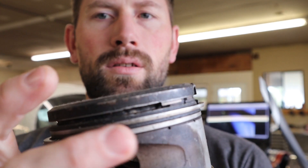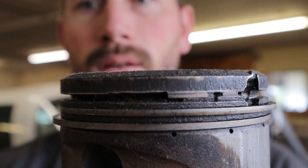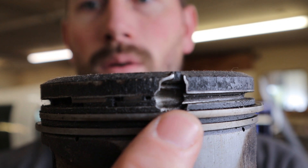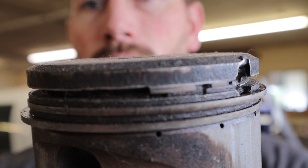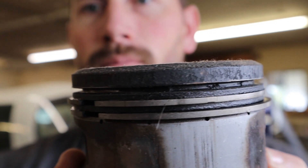Have a look at this — you'll see I have two rings jammed on top of each other. Broken. And then there's this big hole. I don't know what caused that hole — a broken piece of ring rubbing back and forth — but it actually popped out at the top. Really odd. Had I had the bore scope and just popped those spark plugs and had a look in there, I would have noticed something was scratching that cylinder bore, which was allowing more oil to get in there, which was causing the bad mag checks.